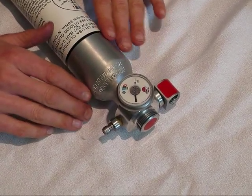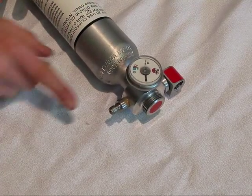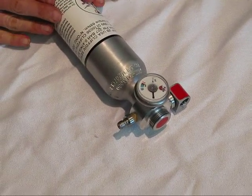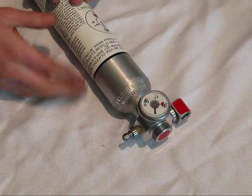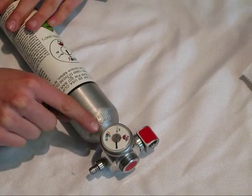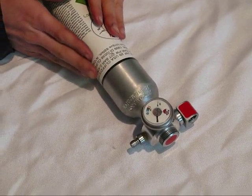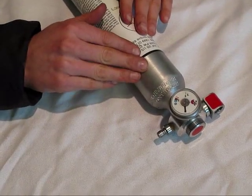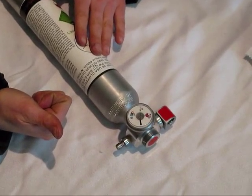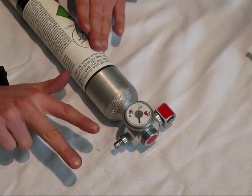When filling the Snow Pulse cylinder, this part is attached to the main tank using a Paintball Quick Link. Make sure the cylinder is filled quite slowly — let whoever is filling it know not to blast 3000 PSI in right away, but to let air in slowly, allowing the gauge to increase gradually up to 3000. Once you reach 3000, the cylinder gets quite warm, so let it cool down and then top it up. Go to a paintball place or scuba shop to get it filled with dry compressed air, fill slowly, let it cool, top it up, and you're good to go.